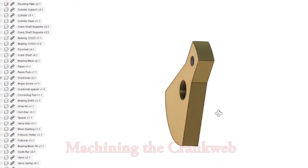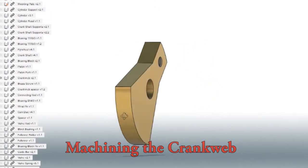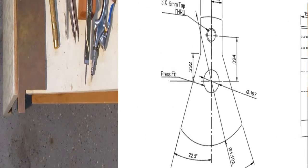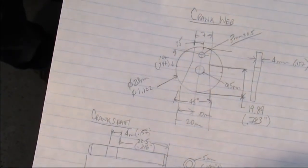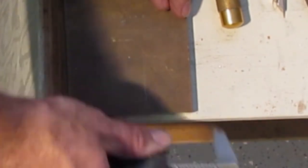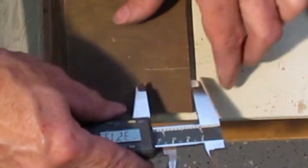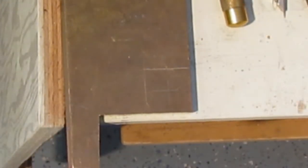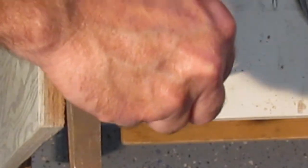The next part to be machined in this video segment is the crank web. Material is brass and consists of a 5mm bore, a 3mm by 0.5 pitch threaded hole, and a milled area. Overall thickness is 4mm. I start the process by laying out the diameter which is 28mm. Adding a little material I then halve the distance and determine the center point. Using an automatic center punch to create a point, I use dividers to scribe a 28mm diameter on the material, mostly to ensure there is enough material around to lathe to diameter.